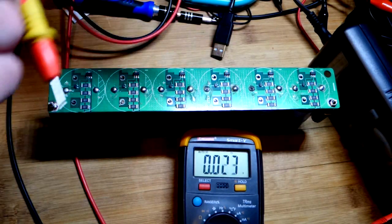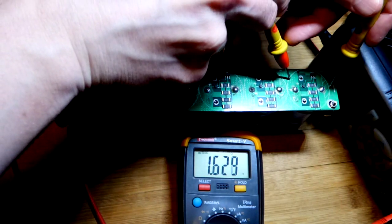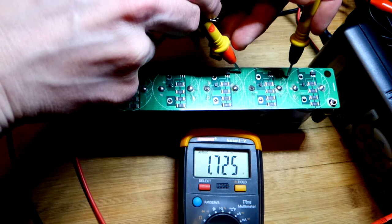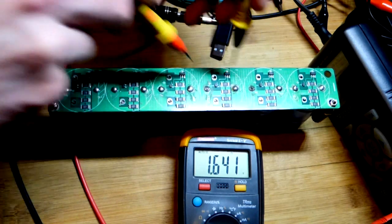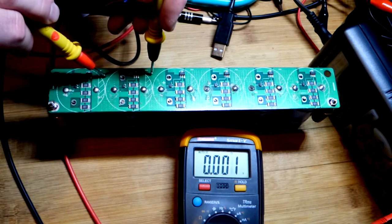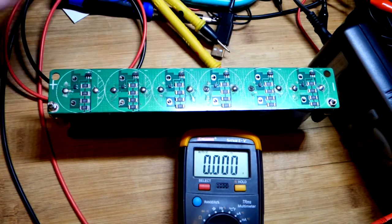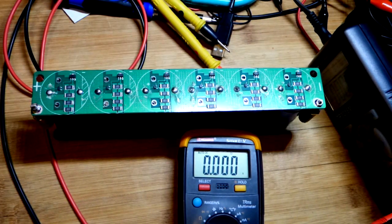The weak cell is a bit shy of 1.7 volts — we were still pushing in about 200 milliamps. As current drops, voltage gets closer to target. Importantly, this only changes the voltage of the one cell we connected across, not the others. That's a nice thing — you can balance them after the fact very easily, as long as the terminals are exposed.